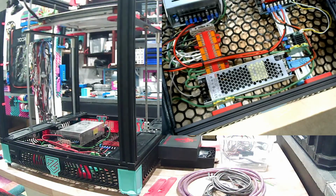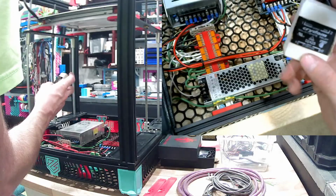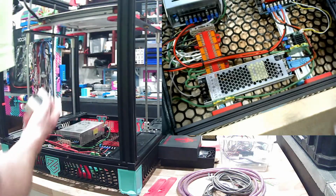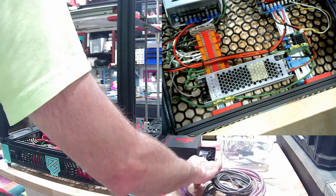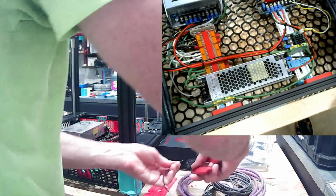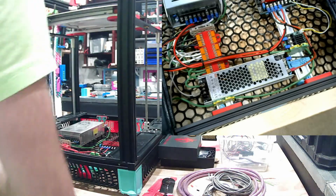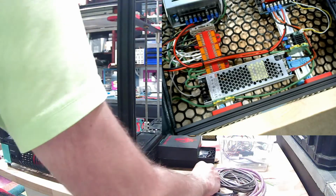The reason you can't use a solid state relay in most cases, like I actually have one right here for a potential future build. Where's the camera? There it is. Got this on sale, 15 bucks at an electronics discount store. This one's rated 240 volt, 25 amp on the heat bed control side and 3 to 32 volts on the DC control side. I was thinking I could just use it for this, but I realized it is an SCR, or silicon controlled rectifier, which if you've ever used one in little hobby electronics pieces, basically once you turn them on and the power starts flowing, you can drop the input voltage to off, but the output would remain on until its power is interrupted. Which would not be good, because then your bed would just be full blast the entire time. Probably have a meltdown. I did confirm that on the manufacturer's website. It cannot be used for DC bed control.